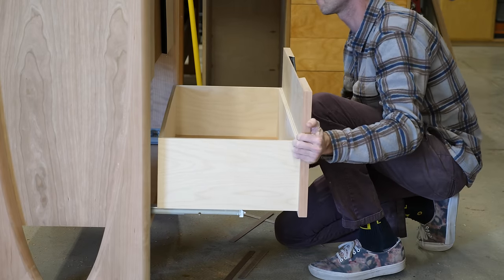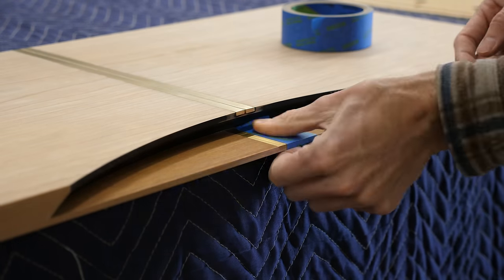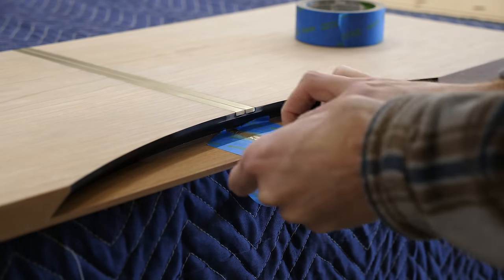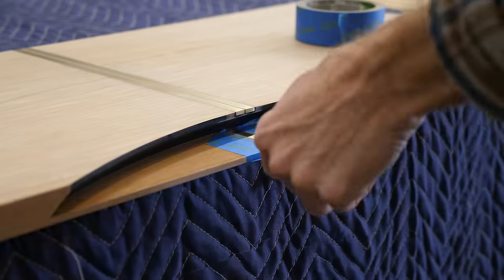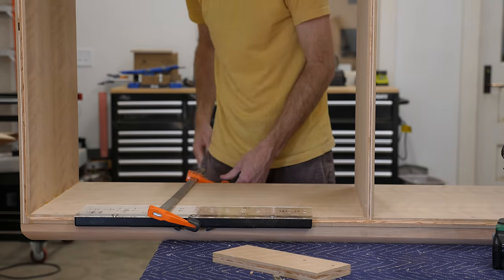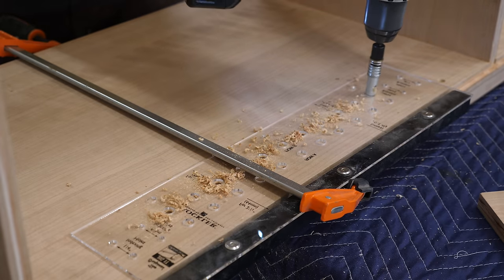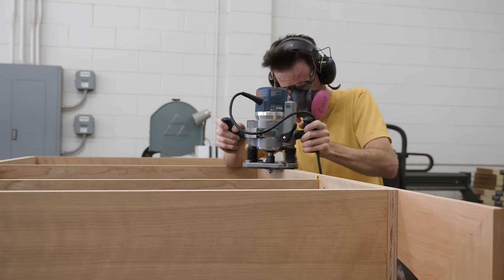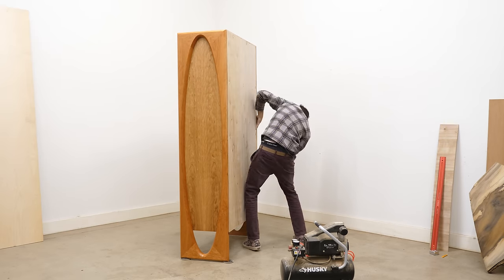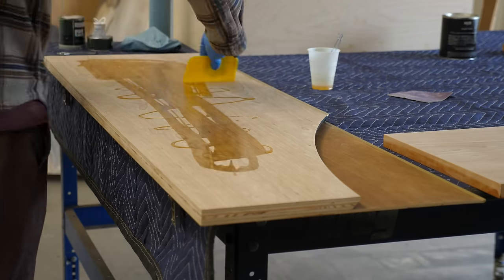I used my favorite drawer front attaching method of using screws slightly protruding through the box to mark their locations on the backside of the drawer front. It works like a charm and is by far the easiest way I've found to do this. If I had my druthers, this is where I would stop a project — I built everything, it all fits together nicely and looks good. All that's left to do is a million tiny little things, and all of them are annoying. Sand up all the brass and make it look nice, but I have to tape off the already-finished plywood areas so I don't mess up the finish. Drill a bunch of shelf pin holes. Cut a back panel and the rabbet for it — using a router in plywood with a partial MDF core creates a lot of dust, and dust is annoying. And of course, sanding and finishing.